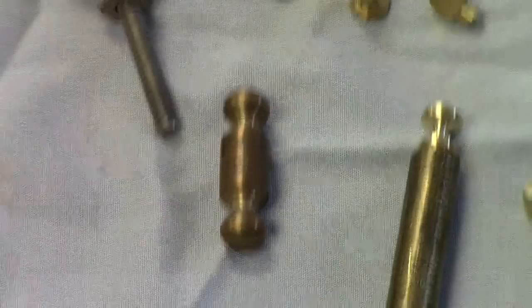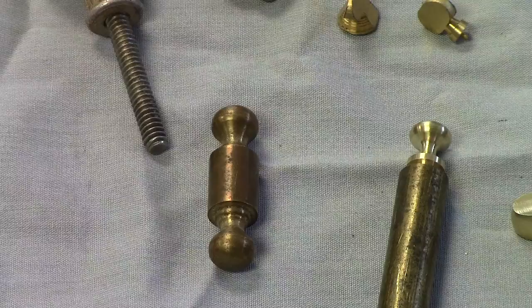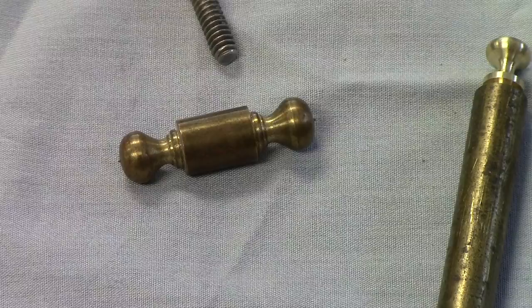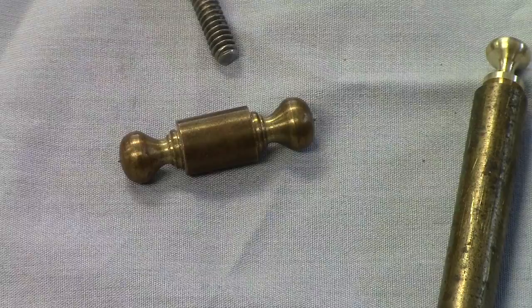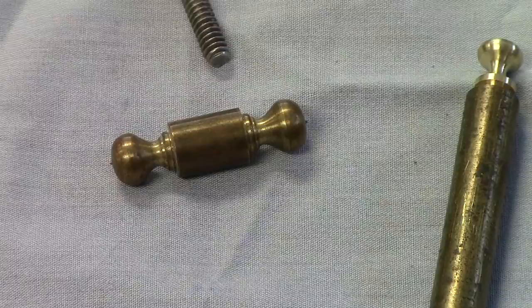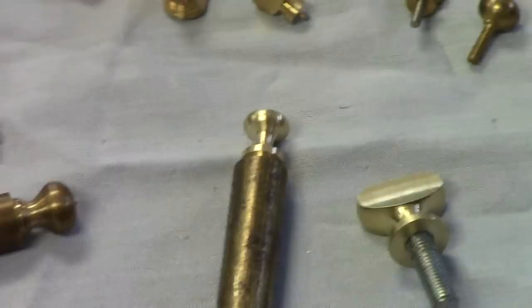The way I typically go about manufacturing these, usually it's always a larger quantity, and I will take the stock and profile both ends in either freehand turning or with a custom profile cutter, and then I'll do the second ops, either parting off or turning it down so I can thread it if I want a one-piece screw. That gives you an idea of the process.